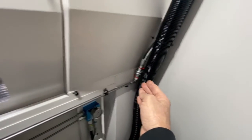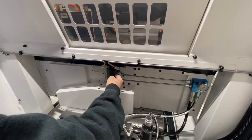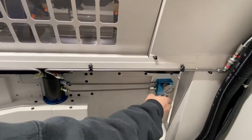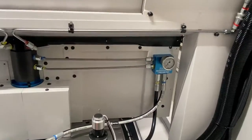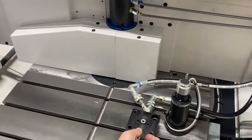The pressure line pushes pressure in and through to your fixture. We plumb into the rotary union with this gauge block here. From there we go on to our fixtures. This gauge block will tell you if you've got pressure on the pump and what it's set at — only on the pressure side, not on the return.